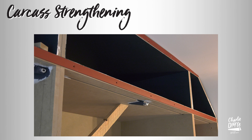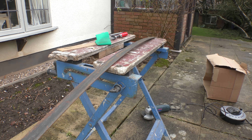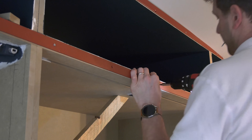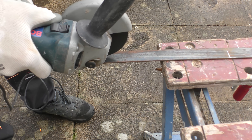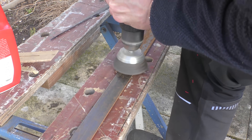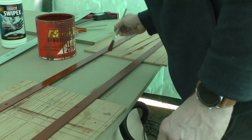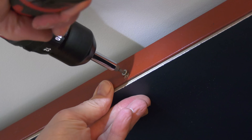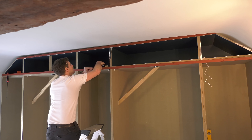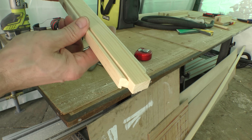Stopping the double-width carcasses from sagging has been on my mind for some time. The solution I came up with was two 4-metre lengths of 3x30mm metal banding from my local agricultural/DIY store, as these provide real stiffness and can be hidden behind the wardrobe fascia. The top band needed a wedge cut off it to fit the uneven ceiling, and I wire-brushed the rust off them before drilling countersunk holes and giving them one coat of Bonda rust primer. I then screwed these to the front of the wardrobe carcass with Spax MDF screws, locating them centrally with 3mm above and below so I could route a groove in the back of the fascia to completely hide the metal bands.